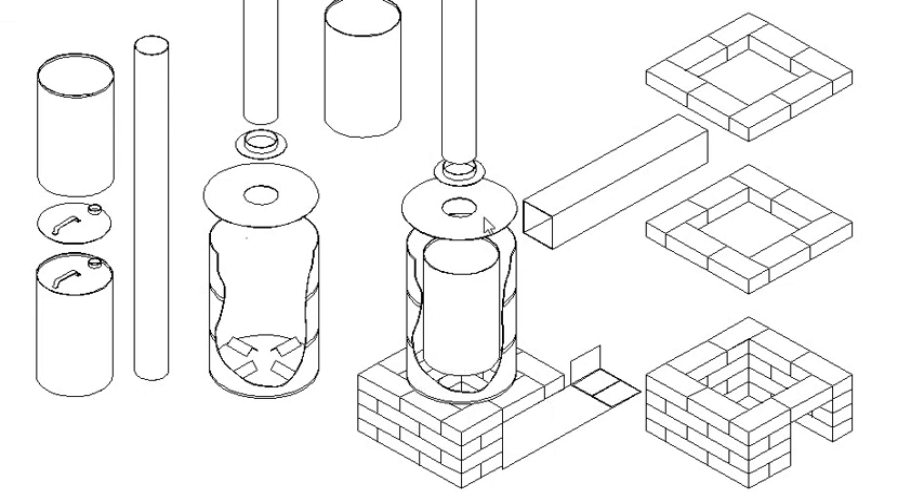If you've got handles on the outside you can lift the outer drum off, and then you've just got this inner drum, so you could get a couple of big pieces of wood and just pick it up. I was thinking about fixing a handle, but a fixed handle has to be gas-tight as well. If you've got nuts and bolts you could bolt a couple of handles to the sides. As for the plate — I've shown it on this diagram as 400mm for the outside of the 60-litre drum and 420mm — if you make that plate it doesn't need to be round, and you can scale it to fit a larger oil drum as well.